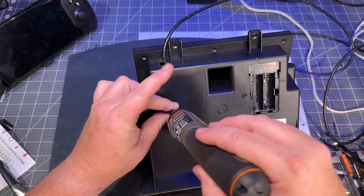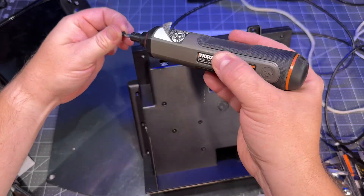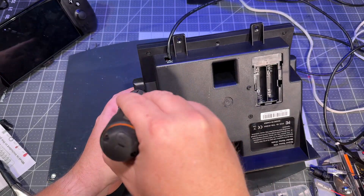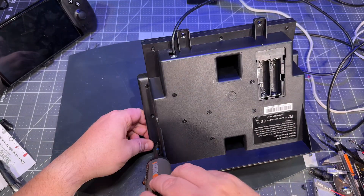Once that's all confirmed, feel free to attach all of the screws back into the controller. Just make sure you're looking at each hole before inserting the screw and that none of your wires are over top or filling that gap. You don't want to screw through and pinch a wire that's showing up in the screw hole — make sure they're all clear before attaching the screws.